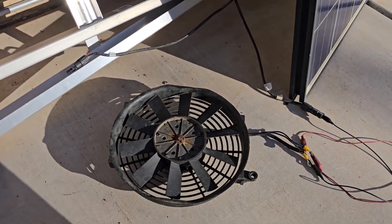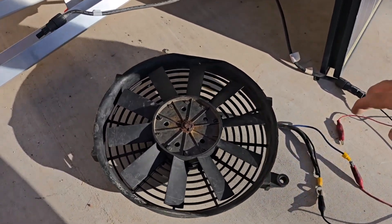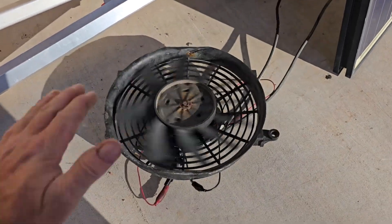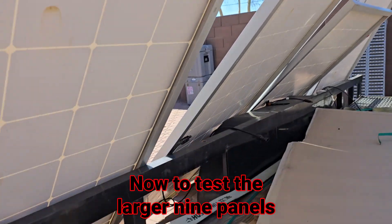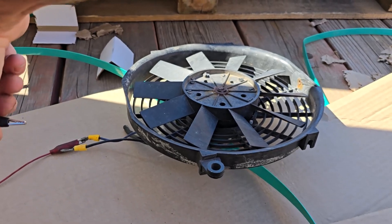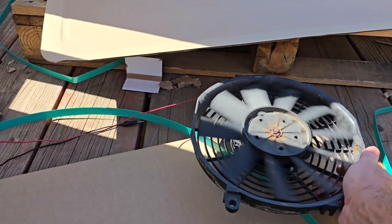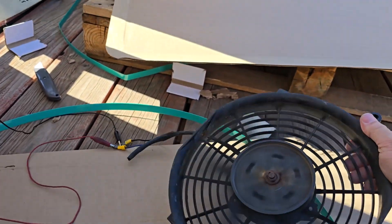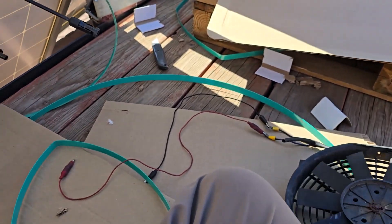Here's my fan — I found this fan to be a very good test. It puts a decent load, takes around a hundred watts. To run the fan at full speed, you can see it just dances all around because it gets so much torque. Got five of my panels laying right here. One quick test I like to do is put this fan on as a load test to see if it's really producing. At one o'clock, these things put out a lot of power — so much torque, the fan just spins in circles. That fan's over-speeding, that's faster than it goes. Panels are definitely putting out.